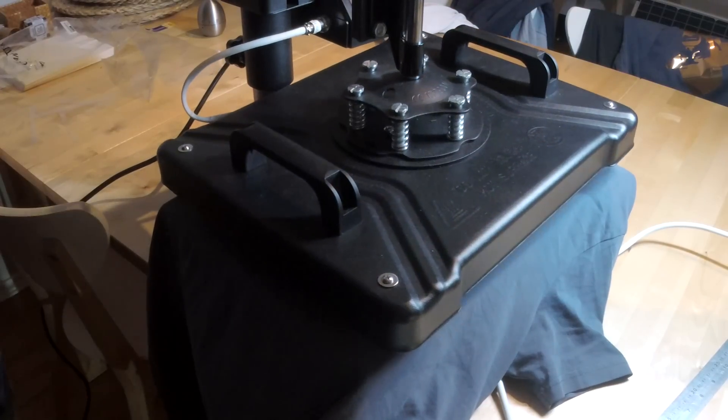The next steps are improving the process. The paper shredder works well but its motor is underpowered. I can envision mounting it below the big shredder so large chunks fall directly into it, possibly with a chain drive from the big shredder's motor powering both — a single process from top to bottom. For melting, I'll experiment with my t-shirt heat press and possibly a sandwich press, which reaches about 210°C — perfect for PLA. With silicone on either side I should get flat sheets in about a quarter of the time. If you have ideas on how to improve this process or cool things to make with waste plastic, please leave a comment below. Thanks for watching — until next time, happy plastic shredding!